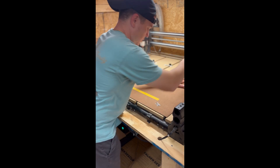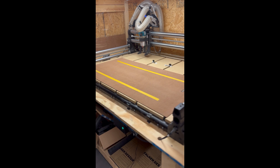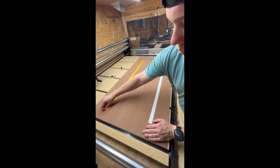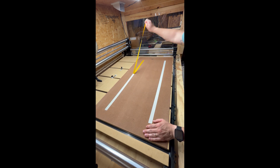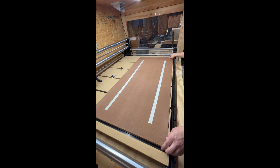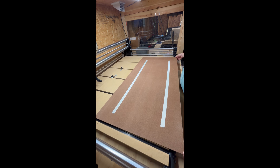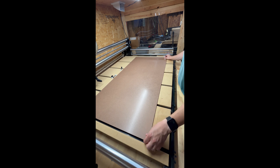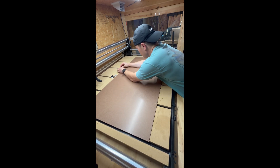I use this double-sided tape — it's super handy with this kind of stuff. It prevents the material from moving around on the machine bed. If you have any movement, the cuts won't be straight. I put this double-sided tape down, make sure it's set, flip the board over, then put clips down towards the rail as well and secure everything. Tape plus clips — there's a lot of force on these CNCs. If your material is moving around, your cut's going to be destroyed. When you're cutting expensive acrylic and making precise cuts, everything's got to be perfect.